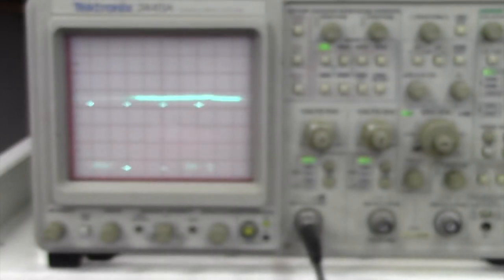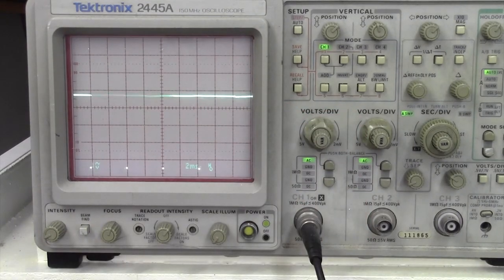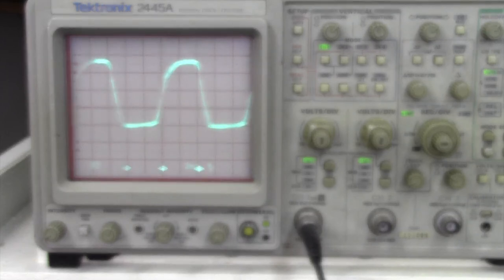So that HT cap has got the correct voltage and has no hum. Just check the other one — the other HT cap. I'll go back to one volt. Ah, that's interesting — that's either a very high signal or something's happening here. Let's just turn this up to maximum — five volts per division. That's interesting, that's leaping off the screen. I'm just going to change the probe to divide by 10, so that's now 50 volts per division. We've got 175 volts of hum on that HT capacitor!